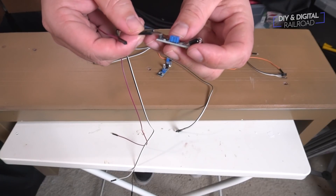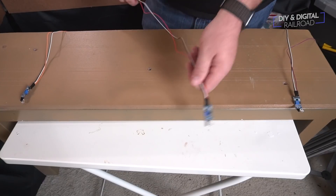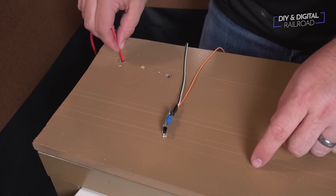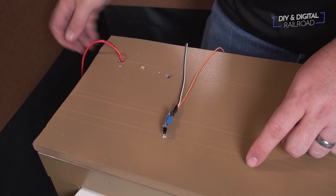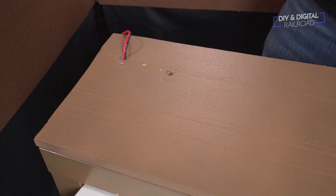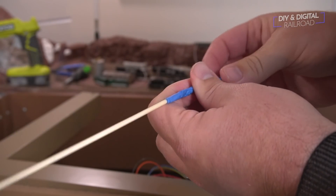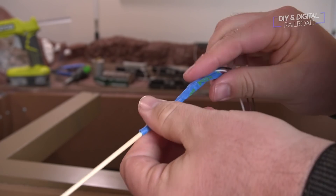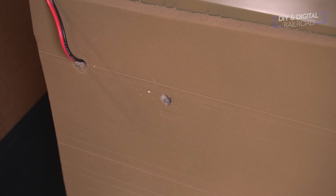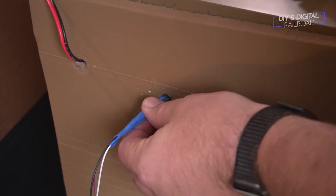Now it's time for some sensor work. I'm using these extra-long Dupont connector wires — I'll link them in the description. I connect the wires to my sensors first, then run the wires through the baseboard to connect with the electronics. The track feeder feeds through to the number one motor output on the motor driver — it's thick enough to feed through easily. The sensor wires are thinner, and the TV stand is hollow inside, so they can get snagged easily. To run them, I line the ends up back to back, tape them to a bamboo skewer, make sure the pins are lined up behind the stub end, seal them with painter's tape, and push the skewer through the hole — which threads the wires through very easily.